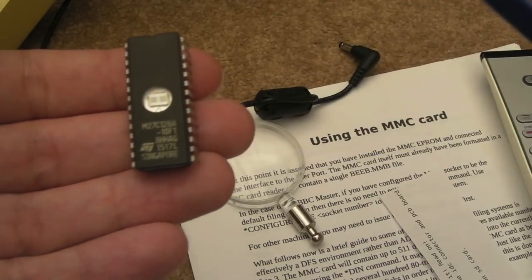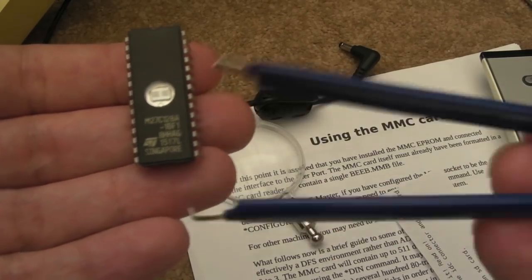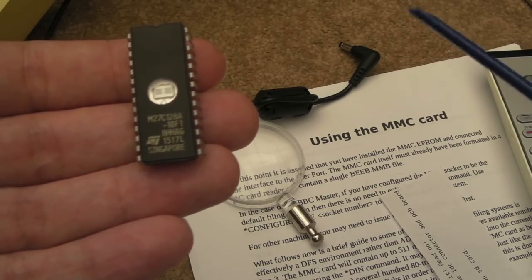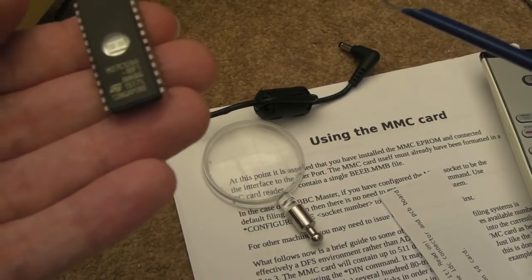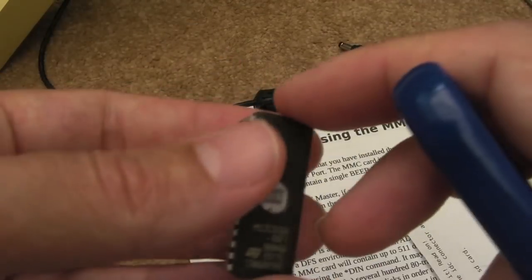That's what I'm thinking, because if I put this in my EEPROM programmer, I can dump it and check the contents against the original ROM and it matches perfectly. I can do a CRC check on it and it matches perfectly. But within the system, it just doesn't. It does exactly what you've just seen, no matter what. So I find that quite interesting, actually.